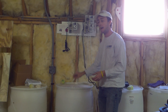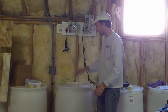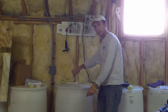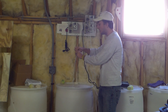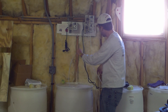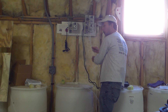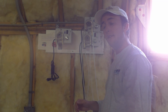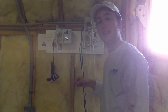Your manager will ask you about the bubble test a lot. To do a bubble test, turn it to a 10. Make sure you're wearing your yellow wristband because we're using chemicals — yellow is the chemical wristband. I'm literally going to lift this line out of the bleach, dip it in, out of the bleach, into the bleach. As I do this, I'm seeing bubbles run through the whole system. I'm going to follow the bubbles all the way through here, on the return side going out, all the way through the injection fitting. During the bubble test, if we don't see the bubbles going all the way through and we just see them bouncing, that means there's an issue — whether it's the line being clogged, the injection fitting being clogged, or our dolphin feeder itself that's broken.